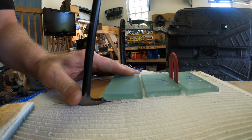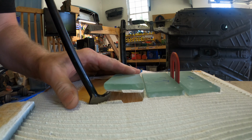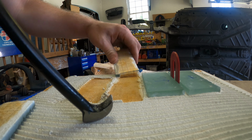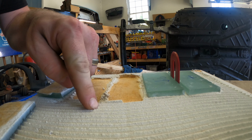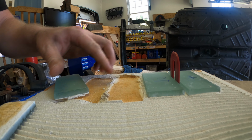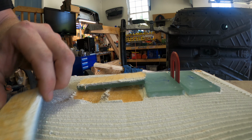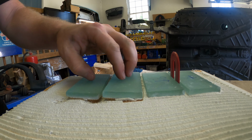Yeah, it feels the same. Yep, peeled a bunch of the fleece up with it. So these are adhering great using the Schluter All-Set with glass. You saw the back of these. So we'll continue on. We'll do day three and day four anyway, but they're gonna end up just like this, right? Where they peel the fleece up with it because they're stuck on there so well.